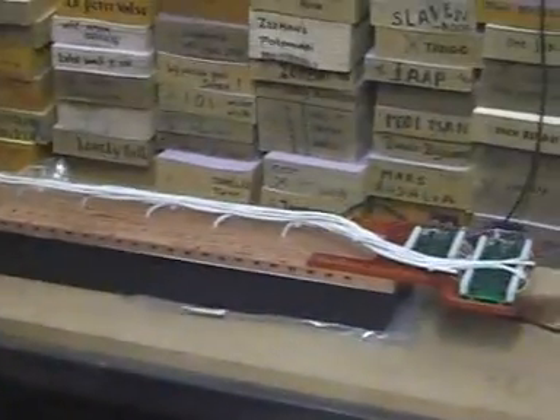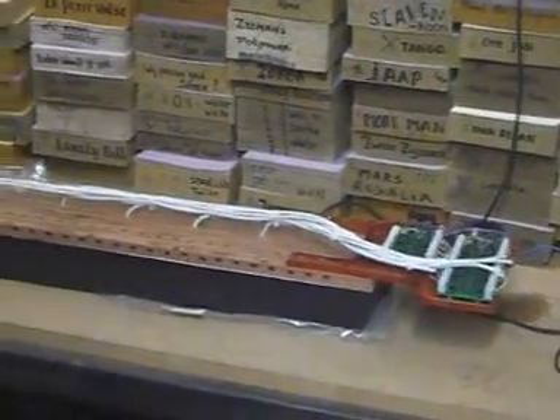Just to show you a bit of work in progress — we've got bits of organ everywhere. That's the keyframe, which needs some TLC when it goes on the bench. With some light helping, you can see what's going on. That's where the keyframe was, and it's going to go back in roughly the same place, a bit higher so we can play longer books without bending the cardboard. In between the keyframe and the original relay, we've got a relay chest — something I've spent a good while making.